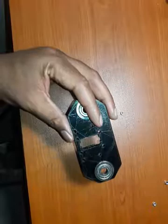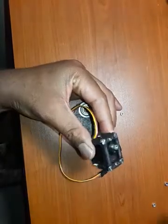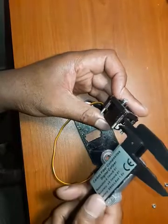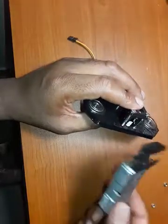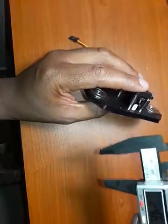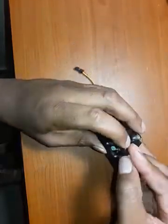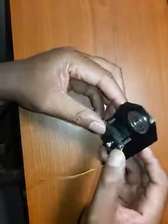Where it gets a little more exciting is you're then going to print out this piece over here — that's your servo holder — and then carry on to print these little standoffs, about 11 or thereabouts. These will go in firmly like so. These bolts are about 25mm and they should just firmly come through this way, all the way through and pop through like this.